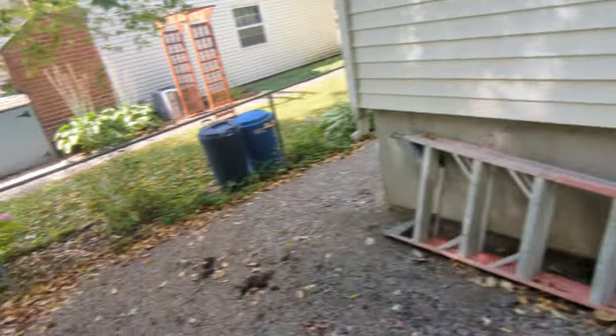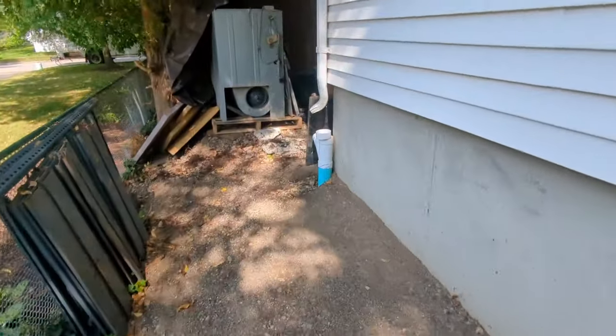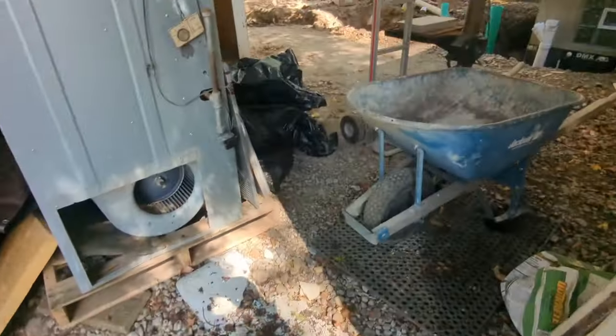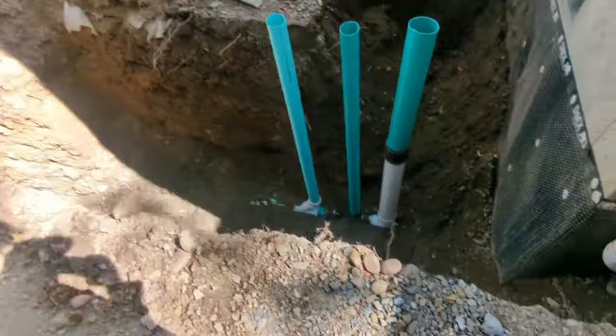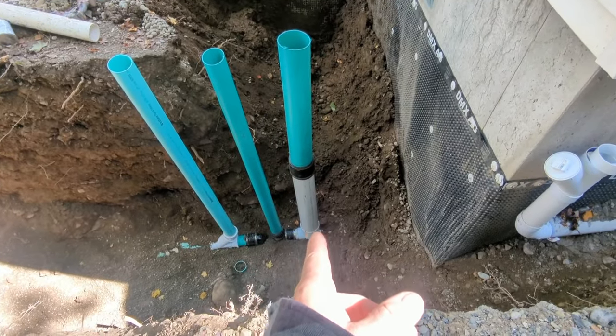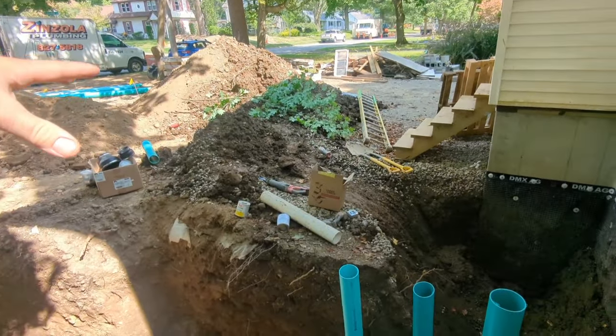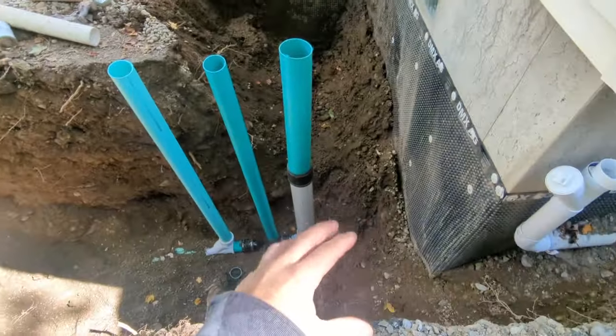Now let's go out and see the guys that got the front yard trenched out. And they're going to be in and out in a day still. He still thinks that's happening, so that sounds good. So the pod won't be trapped in this stuff. It'll be free to come and go again tomorrow. He's got a check valve with a clean out for any kind of service in the future, and it also keeps any kind of unbelievable flooding to the storm sewers from pushing into this house, it won't come in.